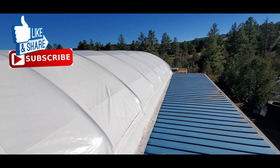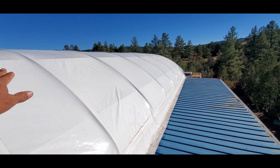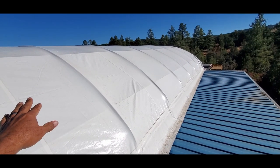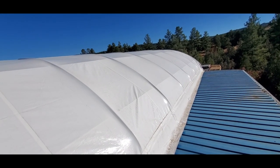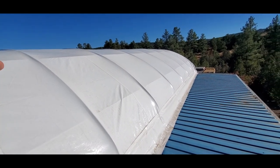If we were going to turn this into a home, the idea would be to throw one of these up quickly, then cover it in plastic to protect the material from the cement, put a mesh over that plastic, and then cover it with an epic mix, or even just a regular ferro cement mix could cover the whole thing.